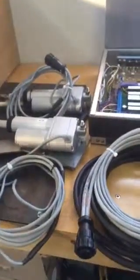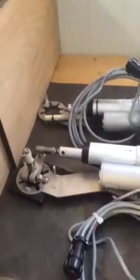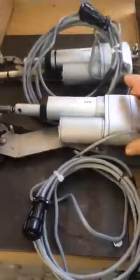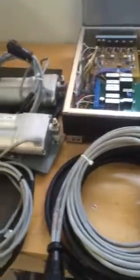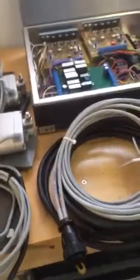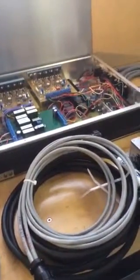In this case we're using the 274 Hamiltons, and so we're using actuators to control the lever valve. These are electronic high-quality DC actuators, and these will connect to the junction box, which connects via jumper cable to the CPU. There's port and starboard here, so this is the complete system for this particular application.